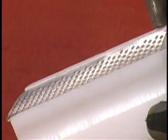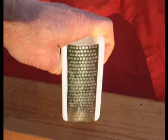Also, check to see that the entire edge of the blade is seated in its groove. If the blade protrudes to the front end of the handle, tap it on a block of wood to seat it against the closed ends of the blade grooves.